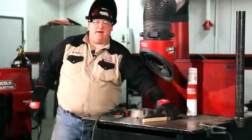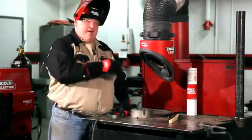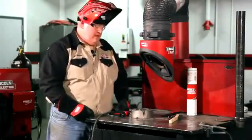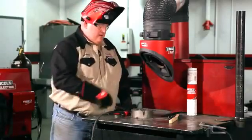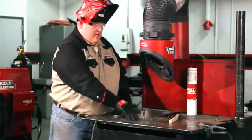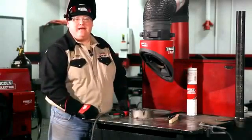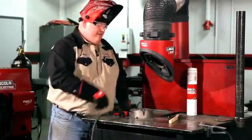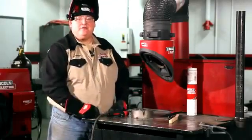If you notice, when I was welding I kept skip welding — taking the chipping hammer and cleaning the slag off while also peening the weld. You want to stagger and alternate your starts to localize the heating. Put a little bit of heat here, a little bit there — move it around so you don't get one area with localized heating. You'll have a uniform bead. Make very small beads and follow that sequence all the way through welding until your casting is completed.